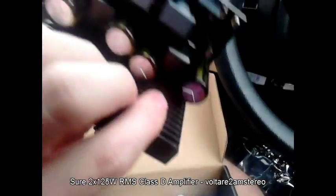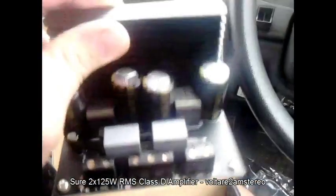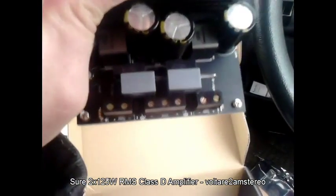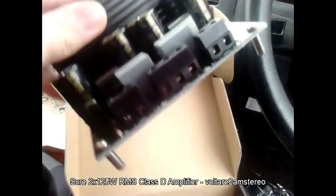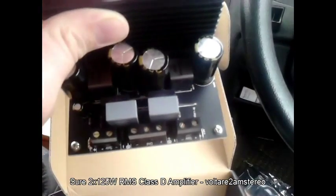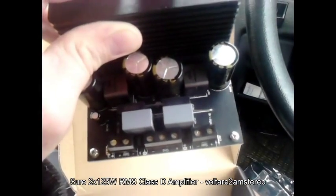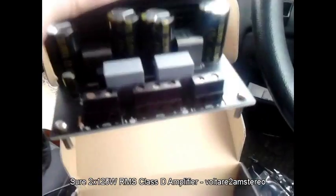This thing is a beast — it's got some decent weight to it and it's huge. Basically, I'm going to use this to replace two of the channels in the Marantz unit from one of my previous videos. It'll happily live on the plus/minus 55 volt supply inside the Marantz. The challenge will be finding somewhere to mount it. Because one of the surround channels in the Marantz is dead, I'm going to repurpose the two front channels off the original amp module as surround channels, leaving one channel unused.